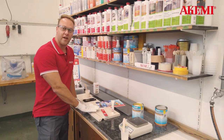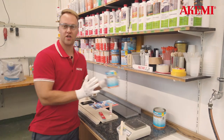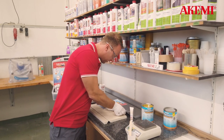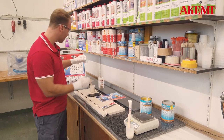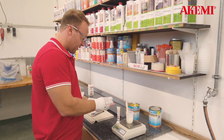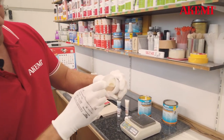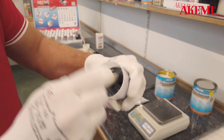Now when you're done with the beige material bonding and you move to a gray, black, or any different material, you don't have to change the platinum glue. You stay with the platinum and just choose a different spectrum paste from the chart. In this case it's a nice gray one, so we go for a dark gray tone. I would choose the 1880 — it's nearly black. I prepared some platinum already. You check again with the flyer which is the right amount. You add it to the platinum and mix, and you see how fast the platinum takes the spectrum paste and adapts the color.